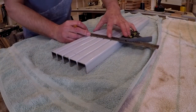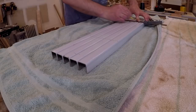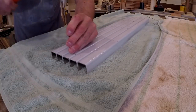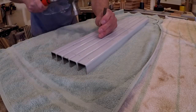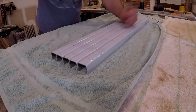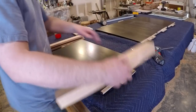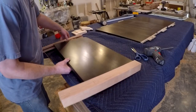These are the stainless steel accent pieces. I'm just marking off where I'm going to put the screw to attach it to the panels. That white coating you see is just a protective layer that gets peeled off later. I used a center punch to make a dimple so that the drill bit wouldn't wander when getting started. When drilling through stainless steel, you've got to use a lot of cutting fluid — as soon as that drill bit started smoking, it wouldn't drill another hole. To help me center the stainless steel accent pieces, I mocked up a little jig.